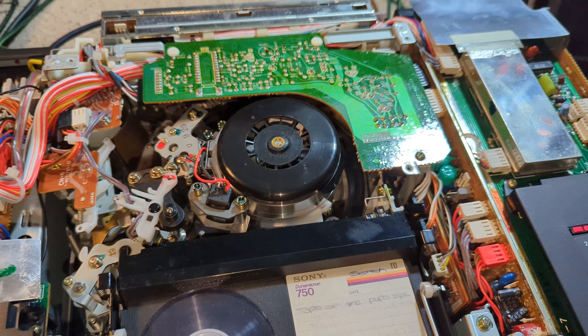Let's check these caps - these are the capacitors I changed in part two and I didn't have time to actually put them on the tester and see how they performed. My guess is they're probably going to be okay, but is it age or just use that makes them break down? They were failing so early on in the machine's life - C7, C5, and C6 - so let's test them and see what 40-plus years has done to them.